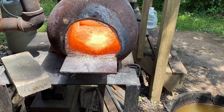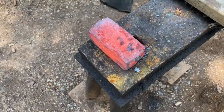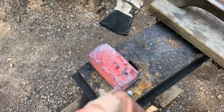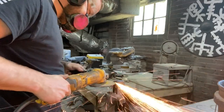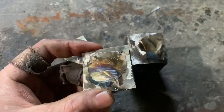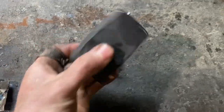During the initial soak, the forge was actually running hotter than I wanted — we were pushing 2600°F — so we got a little bit of cast steel on the forge floor. I'll come in tomorrow with a chisel and knock that out. Here's the billet — we'll let it cool, then cut the ends off and see if we can knock it out clean. Looking at one off-cut, the stainless steel foil seems to have done its job — there's a visible seam all the way around. The other end looks solid, so I'm going to try knocking it out from that end.